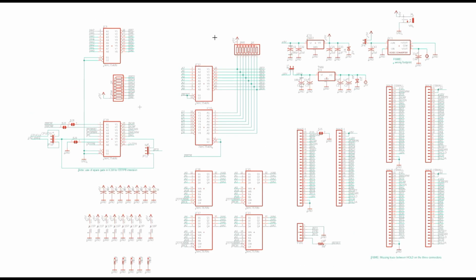Let's zoom out here. So the H8 bus, you've got a bunch of connectors over here. These are the H8 edge card connectors. There's actually 3 sets of them because I have 3 different kinds of connectors that can hook up. So just pretend one set doesn't exist, the other does. It's a 50-pin connector that connects the board to the H8, and all of its signals will go through these other buffers. So there is an address buffer where we take the address signals and we send them out onto the H8 bus. The H8 bus uses inverted logic, so we have to invert all of those address bits and we dump them out on the bus.